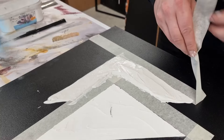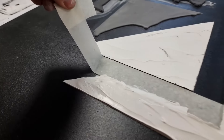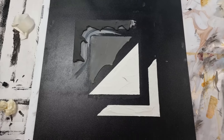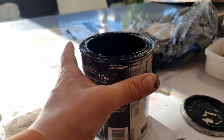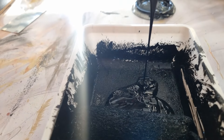Remember to remove the masking tape before the plaster cures. This is how it looks right now. When the plaster has cured we put down another base coat over everything so the plaster doesn't absorb all the colors we will paint on it later.